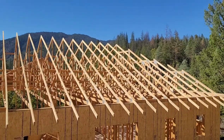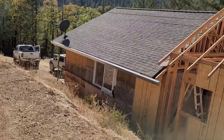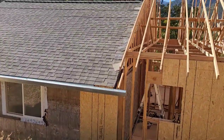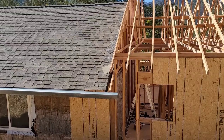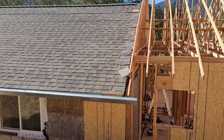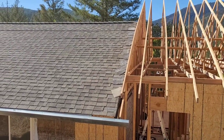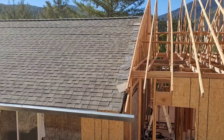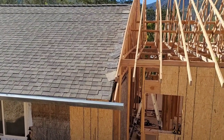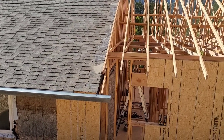We're really happy. There's one truss in between there and the garage that Mike has to take a little time to set correctly. But being that we got this last truss in, if you notice, it's got a lot of wood there, and he's able to get that truss exactly perfect and screw into this other truss and then block up from the double plate of the garage.